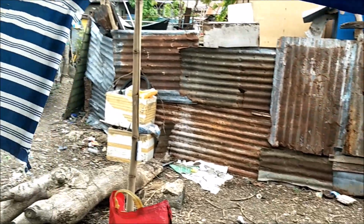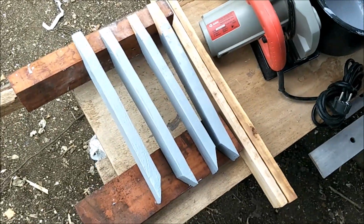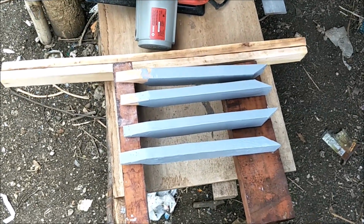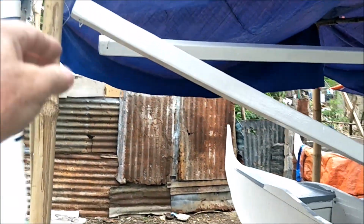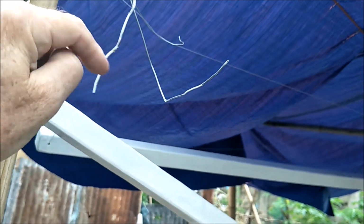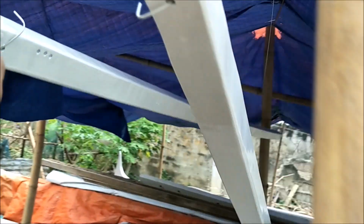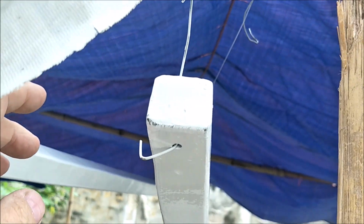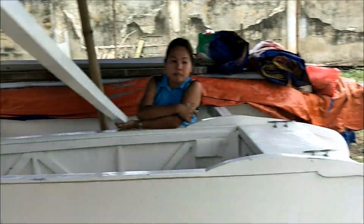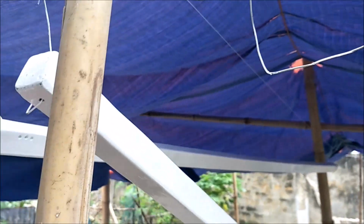So that worked, and we are taking them down, and we are letting our little ocean spray splash guards dry. So I got to take this down. We just ran a wire through all of them, they have holes in the end because they bolt to each other. We just bent a wire and hung them through there, see, like that, and then they would hang and we could paint. And then we just tied them off here with a little simple loop, and you could adjust that up and down. So for painting they were down, for drying they were up.